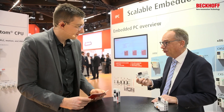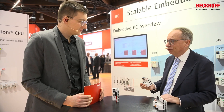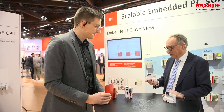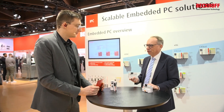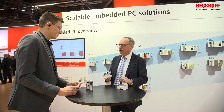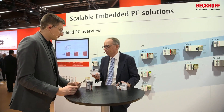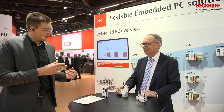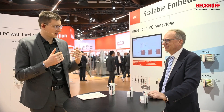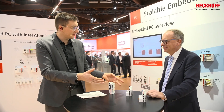A small controller also has on-board IOs which you can use for different applications. We have eight digital inputs and four digital outputs, and you can configure this — we call these multi-configuration IOs. You can use them as a fast counter, incremental encoder, and we have two analog inputs and PWM signals. All of these IOs are usually separate terminals, and if you would buy all of these functions, you would almost spend the price of a CX7000.